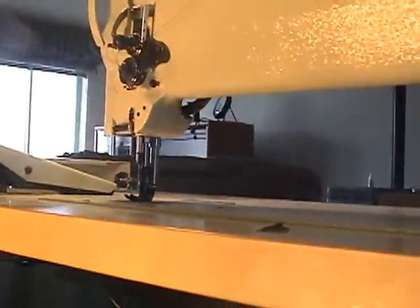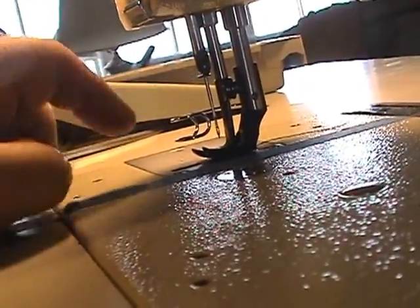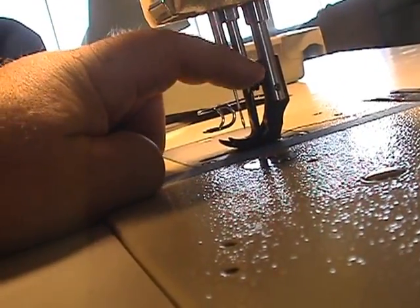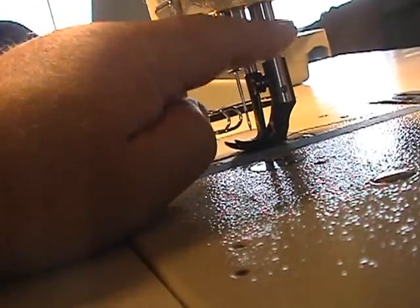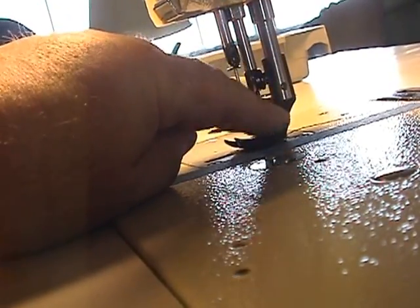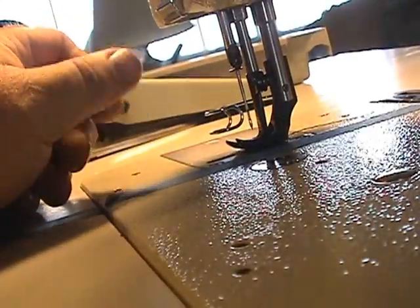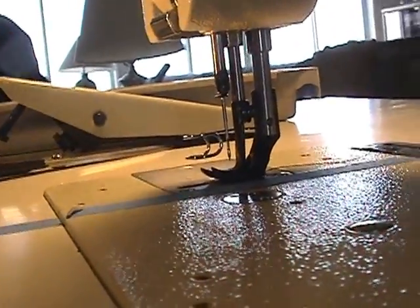Look for my next video because I kind of go into that head — that foot lifter was sticking on me. As you can see it's walking pretty good right now, but once that walking foot went down and lifted the vibrating foot up, it stayed up. That shaft right there — that bushing was so tight that it wouldn't let that go down even with the spring load adjusted up quite high. So we're going to talk about that on the next video.